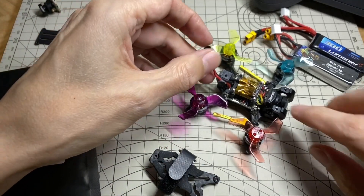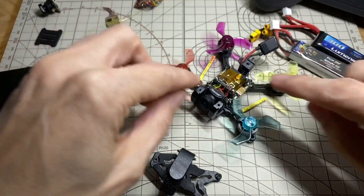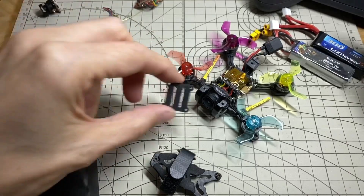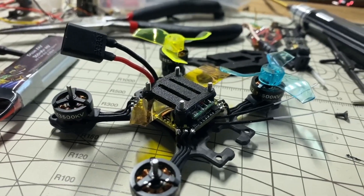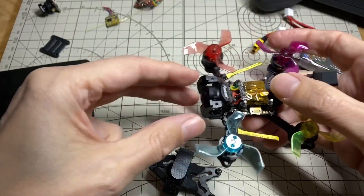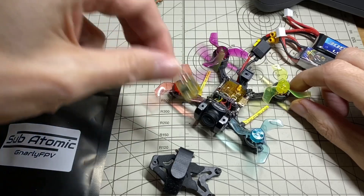Another thing I changed over the previous version was I went for a lighter gauge wire for the battery connector — 24 gauge — so with this lighter wire I could pass it through this little opening in the rear TPU mount for a cleaner setup. On top you can see the TBS Unify Nano VTX, just taped to a little TPU platform I designed quickly in Tinkercad and 3D printed. The receiver is sitting underneath that, and then the VTX is taped on top. You can see the RunCam Nano 2 installed — it does fit, the wires are getting pretty close but nothing's too bunched up. And there are the XM Plus antennas, using the classic zip tie method for securing those — much better RF performance than I was getting with the little V-receiver.